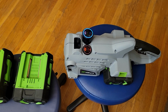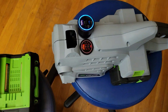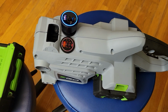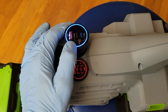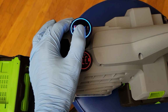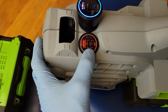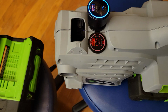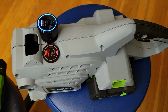When I had a 100 watt load on it, I also got about 1% voltage drop on the 24 volt side, and then maybe 0.5% voltage drop on the 56 volt side in addition to that. So you're going to lose 5-6% before you even get here, and that's fine. Then once you get here, you've got 24 volts coming in, and it's going to buck that down to 20 volts in this case to make the PD100 output. This has got PD100 output times 2, and this is PD30 times 2, which is actually a 12 volt output. So it's going to have to buck from 24 down to 12. Every time you have those conversions, you have a little bit of loss, but that overall is not too bad.